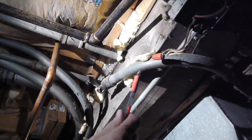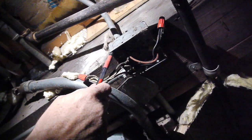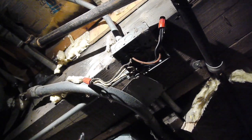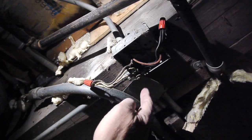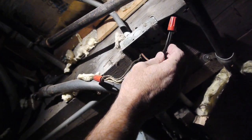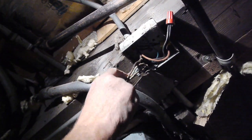Now if we switch over to here for a second — this is what a handyman does. This is another electrical deficiency you should look for in your home. We usually find open electrical boxes like this above ceiling tiles in garages or in attic spaces where the last person doing the electrical work assumes no one else is going to see it. These wires are supposed to be placed inside the box, and the box is supposed to have a cover on it. This space is only about six feet tall; a tall electrician who was bald and hit some of these wires without wire nuts on them could be electrocuted. Also, these are commonly chewed by rats and mice, who can actually live off of the insulation on the wires.